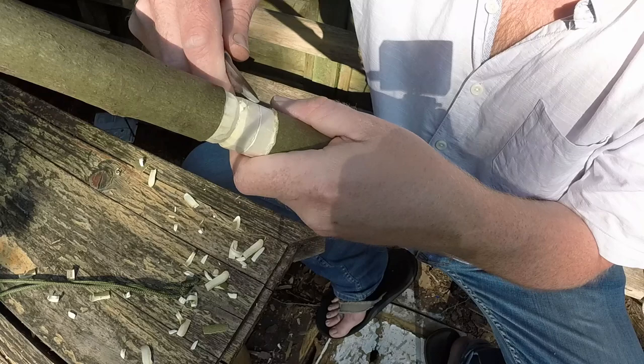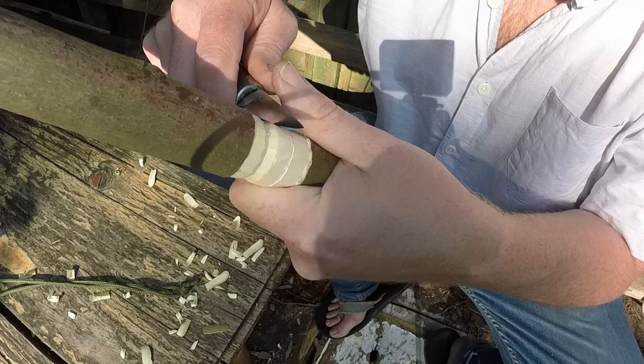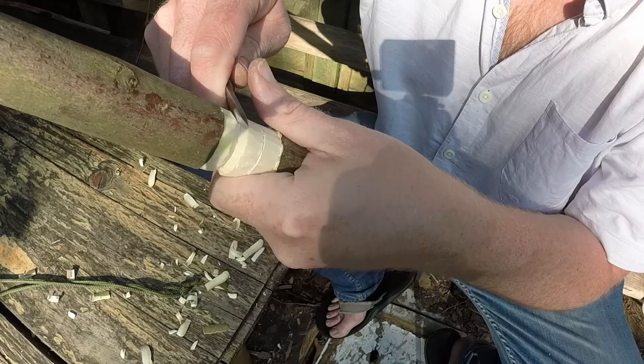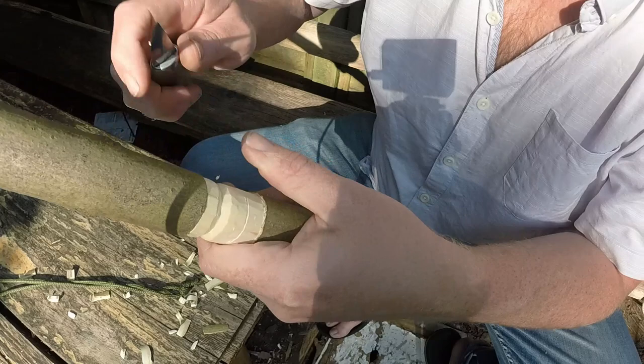This is a great beginner cut. You can do just with a stick and get some really nice patterns going. This doesn't have to just go round in a circle - you could be doing a spiral down the wood. Whatever line your stop cut follows, you could spiral it down and do the same technique. You can also curve and roll the edges rather than cutting straight edges.